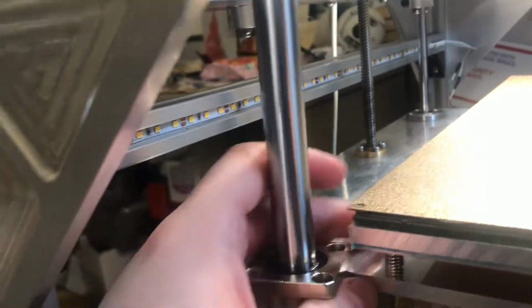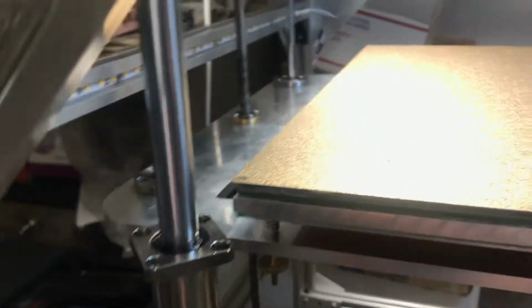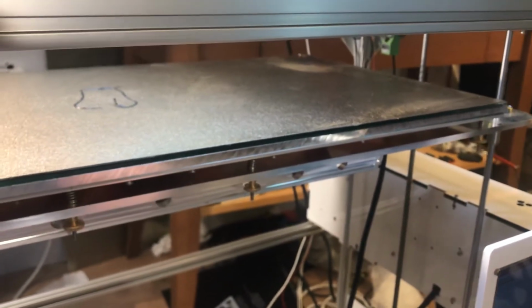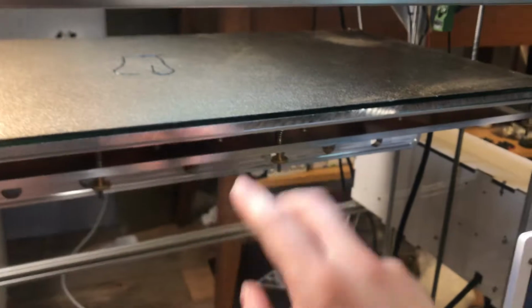It's massive. So too will we change the lead screw from this ACME trapezoidal 8mm to at least a 12 or possibly 16mm ball screw, so that you can get a lot more precision with the decreased friction that the ball screws offer when dealing with such a heavy bed, due to the need to have true leveling with MIC 6 plating here on the bed to help it not sag in anywhere, unlike cheap Chinese printer beds that have some of those dead spots in them. This is a very flat, true level bed.